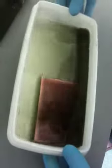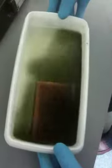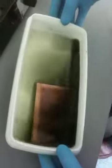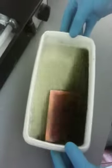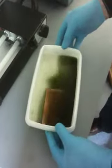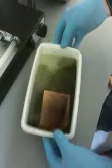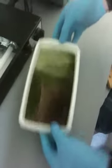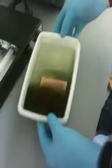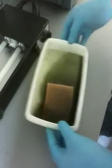Is it possible to overdo it? Well, it depends on the concentrate. If you have the concentrate right, like mixed one part concentrate to nine parts water, you can just take your time and it should be fine. So you've been doing it for about 30 seconds now. Yeah, about a minute at the most, until all the actual colour comes off and we see clean copper. I can see it's quite bright now. Even when it's all moving, we can actually rinse it off and it's usually quite good. That's just nearly done now.